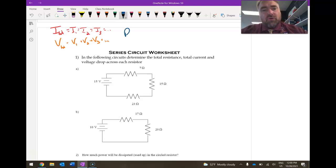And then the last rule is that the total resistance is equal to the sum of the individual resistances: R1 plus R2 plus R3, and so on if there are more. This is based on the fact that resistance is directly proportional to length, so every time you add a resistor in series, you're essentially making the total resistance longer.